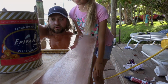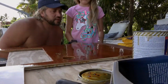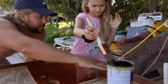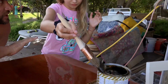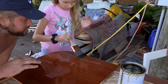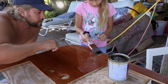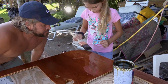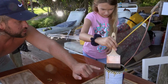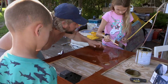Look how smooth it is here. That's going to become like that as well. So now you can do this side. Now remember, you don't want to take your brush over where you've done that. Once you've done it, it's done. You have only one shot with varnishing. So you need a little bit more varnish quickly. Okay, there's a holiday, a big holiday there. So quickly take some more. I did this before. And then do it there.